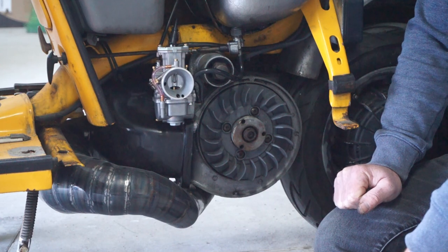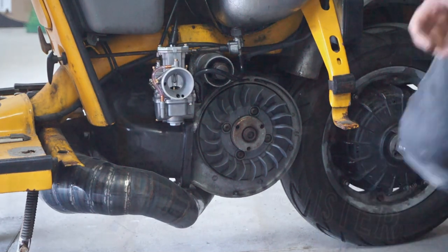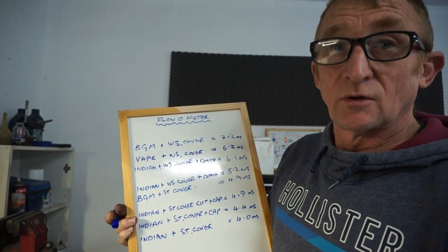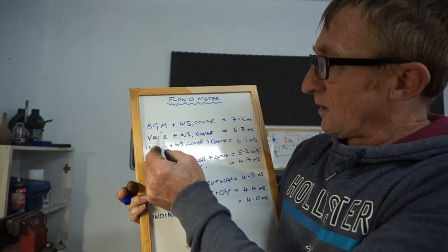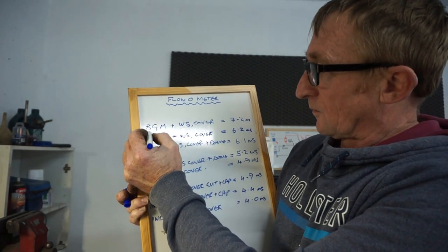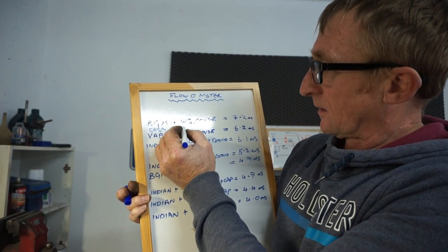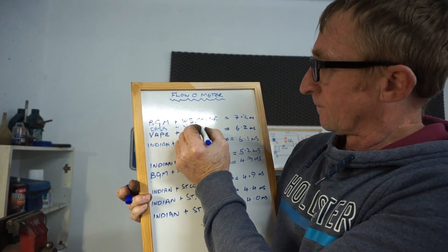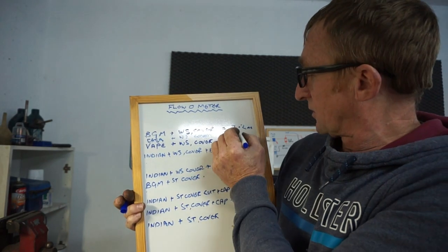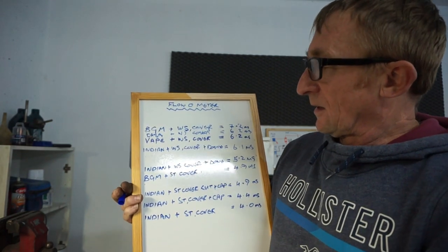It's down. So back to our leaderboard and we'll chalk in our new results. So here's our leaderboard. BGM is still looking like number one at the moment for airflow, but now the Casa Lambretta is coming level pegs with Vape. We'll put it in. Casa with my cover, and it got a very nice 6.2 meters per second. But then